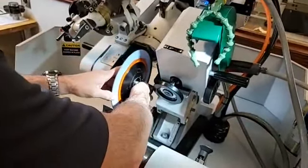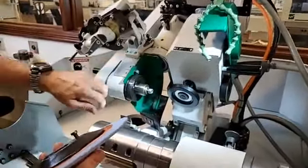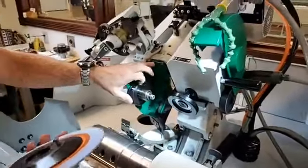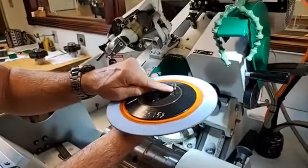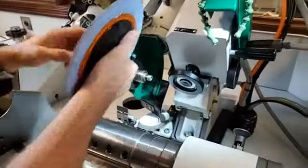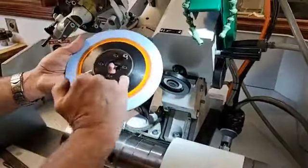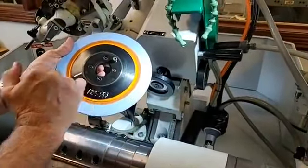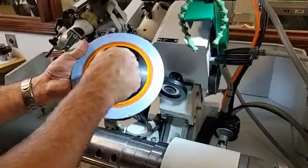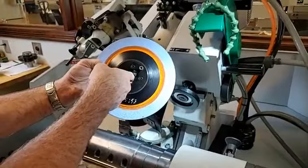So I'll show you how that works in reverse. Okay, you can see this little hole here. This whole assembly turns around and obviously threads in. So what happens is this bolt head goes into that keyway. Once we roll it around, it grabs that tool and seats it on this outside spindle edge. I don't know if you can see this or not, but there's a little shiny edge along the outside barrier of this hub. That is our actual seating surface. So it's a complete tall edge versus the old style, which was only seating around this tapered shaft or cone.